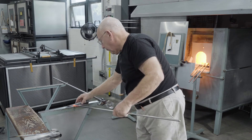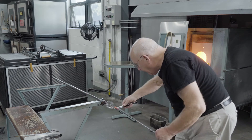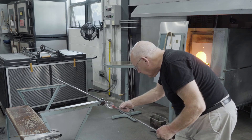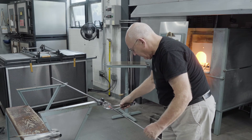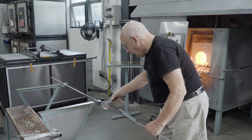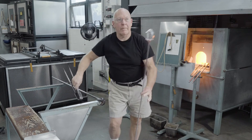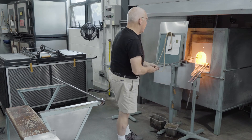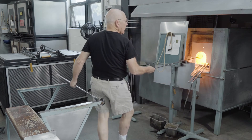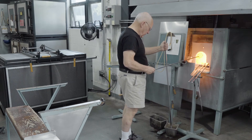The end is flattened and blown on gently to chill it. It's touched to the center. The tips of the pincers are held in the crevice or neck and tapped against the right arm of the bench. And the reheat begins. This is the beginning of the furnace-finished rim.